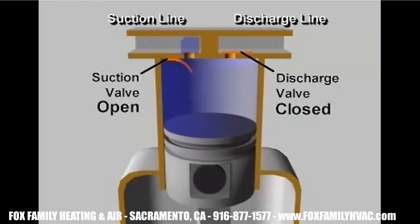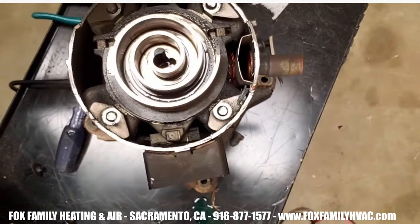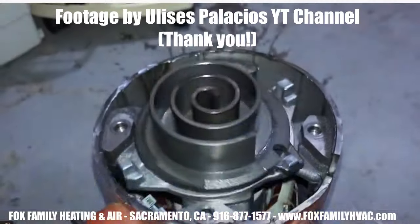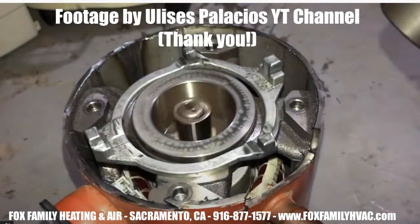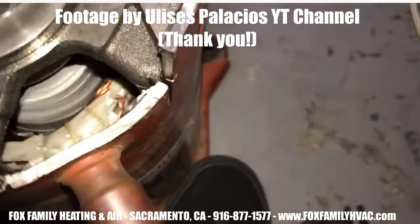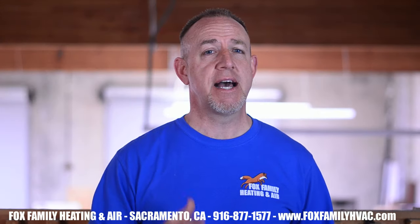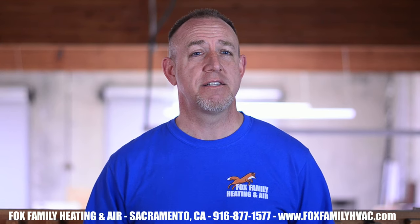Bad valves — are you sure? Something I hear a lot is that the compressor has bad valves. Well, today's scroll compressors don't have valves. They do have bearings that can go bad, but valves were an issue with reciprocating compressors in earlier models. If you have decent refrigerant levels but the compressor has problems starting and running efficiently, a lot of vibration, or a metal clanking noise, you could have damaged bearings. It's caused by refrigerant wearing out the oil and creating a situation where copper plating occurs. From there the compressor overheats and draws higher amperage. You're going to see higher amp draws the hotter it gets outside, but if a compressor is running anywhere near its RLA and the refrigerant charge is good, that compressor is hurting. It could have bad bearings, not bad valves.